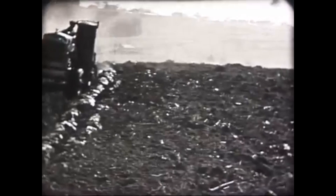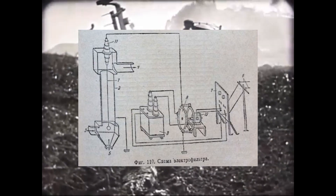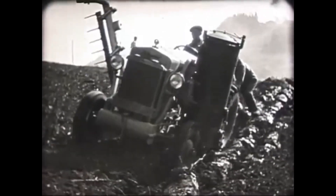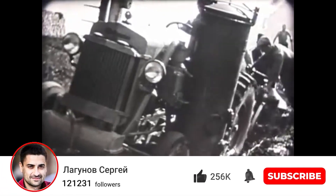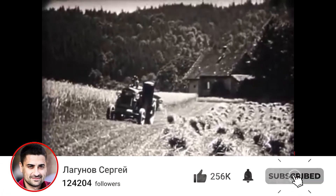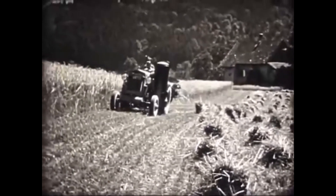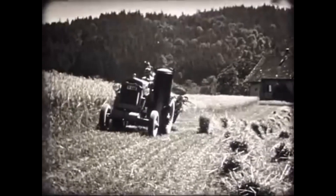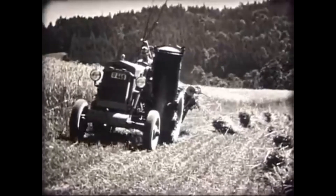A corona electrode is always negatively charged and a deposition electrode is always positively charged. The ideal corona electrode would be a thin string about 0.3 millimeters in diameter. The thinner the electrode, the stronger the field that electrifies the dust. The dust will stick to the walls of the tube in which the string is located strictly in the middle. I speak simple language so that the audience can understand me — scientifically, the whole process is so complicated that no one will understand anything. The thicker this string, the worse the process goes.